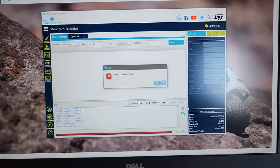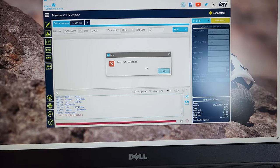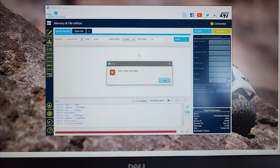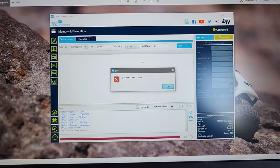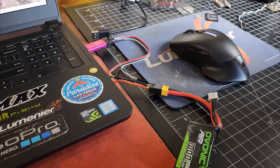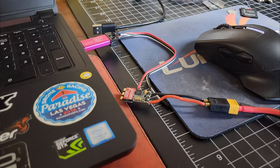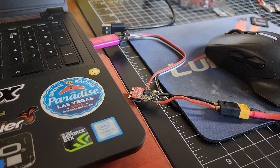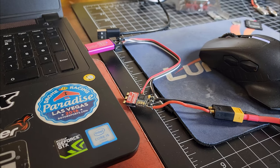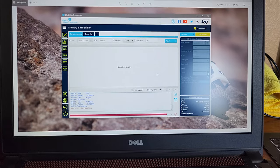This particular ESC doesn't have any LEDs so it's not going to do anything when you plug it in. Go to the cube programmer and hit connect. If it says 'data read failed' that's normal, because this cube programmer isn't designed to read BL Heli. There's another error where it says 'no STM target found' — if you get that, it means the ST link is not communicating with the ESC. It could be crossed wires or a driver issue; Jess had that issue and switching computers fixed it.